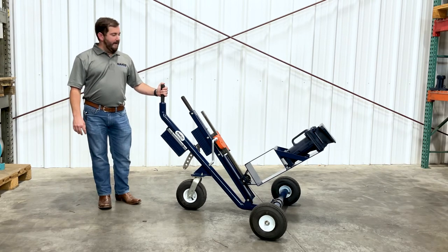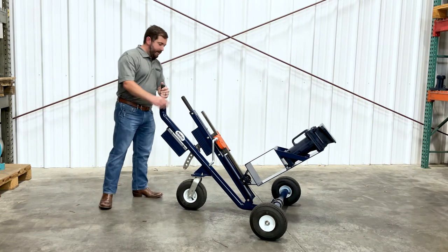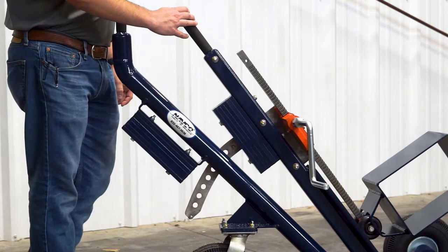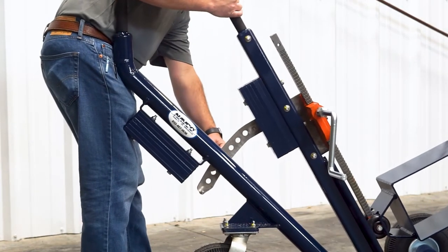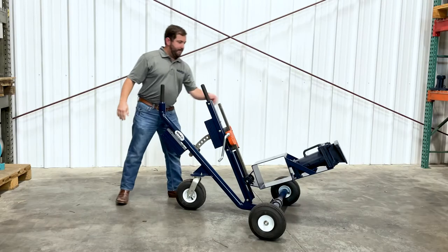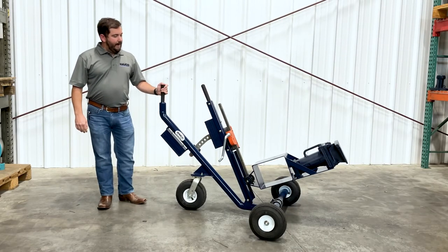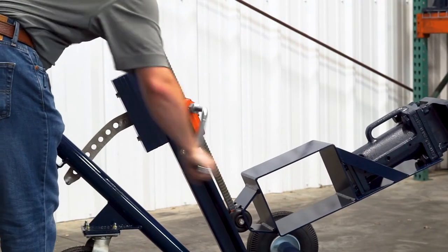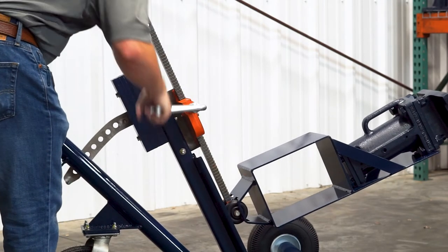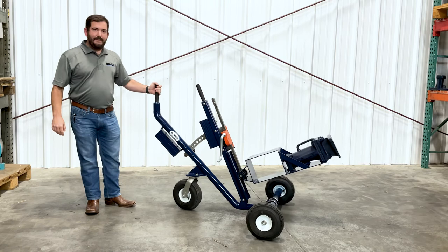Hopper railcars come in a variety of hopper angles, and so the cart is designed to accommodate that range of angle. It features an adjustable angle for the placement end of the device. It has a rack and pinion system designed for lifting and lowering the HCP vibrator, and also features a three-wheel arrangement for navigation in tight spaces.